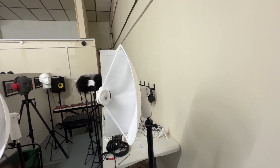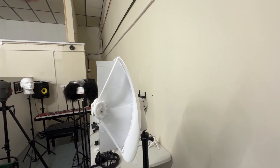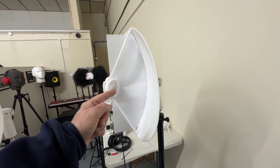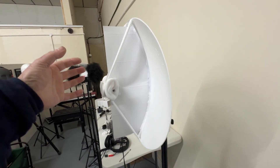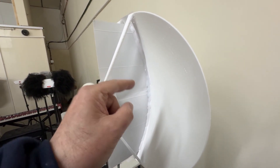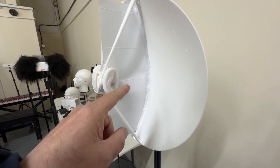Binaural microphones are extremely good at picking up sounds in all directions - we know that because we're humans and we hear everything all around us, above and below. The sound focused by the dish would always be from in front, if those ear shapes perceive the correct perspective. So anything else would be perceived around you, with the focal point amplified. It's a bit like a wide-angle lens for everything, but with the center bit zoomed in and focusing on what you're pointing at - that would be the loudest thing recorded, but binaurally.